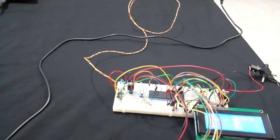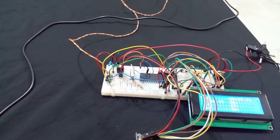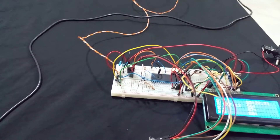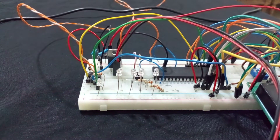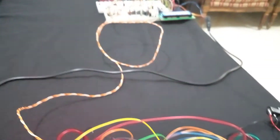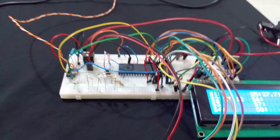It's about controlling the outputs of microcontrollers. Each microcontroller will have four outputs — one master and 80 slaves. The slaves are connected through an RS485 bus to the master. The master acts as a web server and is connected through an Ethernet module, the ENC28J60, via a Cat6 patch cord to a router. The master controller has four LEDs that will be controlled, and one LED is just to show that it is communicating with the slaves.